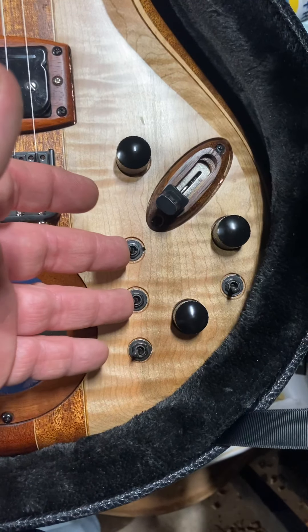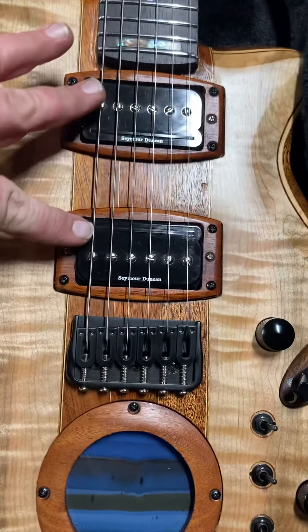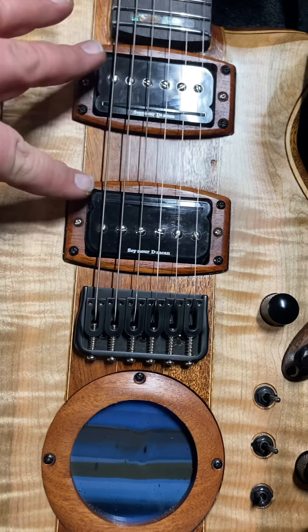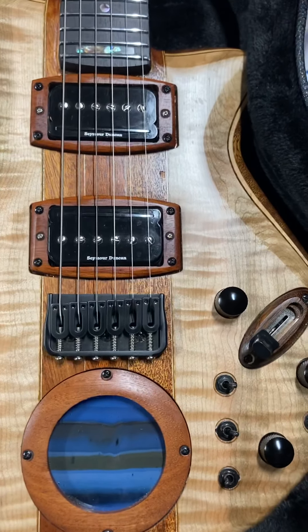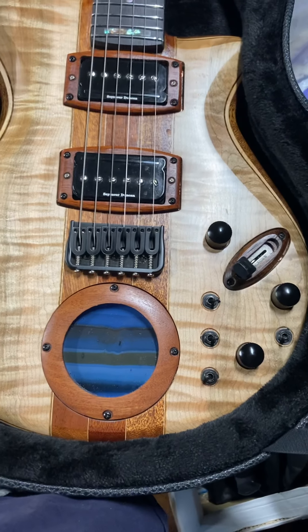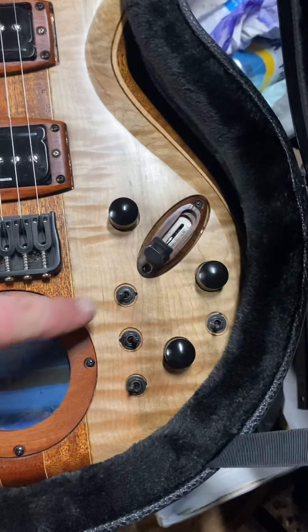If these two are both down, you are in series with these two pickups and in parallel with these two pickups. They'll sound like a PAF — like a regular humbucker, not a real powerful one. Like your normal humbucker guitar, bright, early Gibson-sounding humbucker.